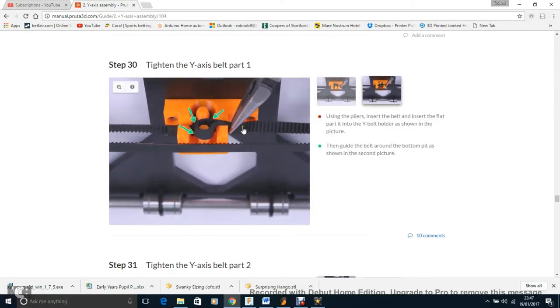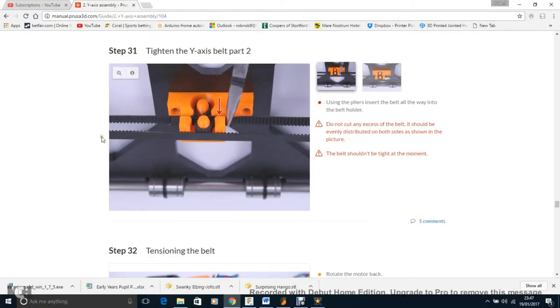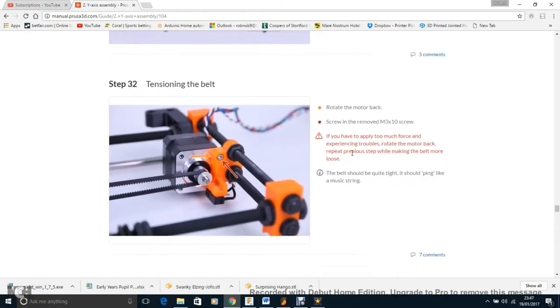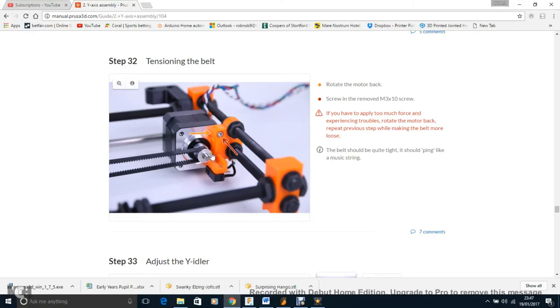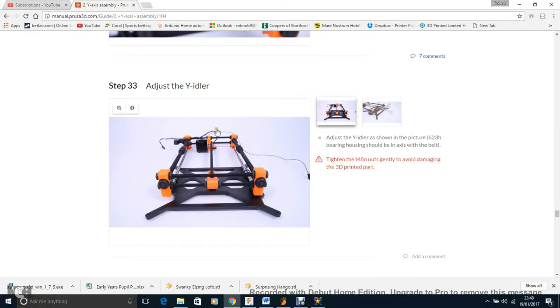Do the same with the belt again — get some excess and you want it quite tight already. Then squeeze the belt together: it should look tight already. Tighten it even more by putting the motor back into place. You get maybe half a centimetre to a centimetre of play when you loosen that screw, and tightening it back tightens the belt. As the guide says, it should ping like a music string — mine does too, a nice little 'dong'. That's exactly what you want, because you don't want it skipping steps. Make sure the belt is completely straight, otherwise the plate won't reach the end stop.